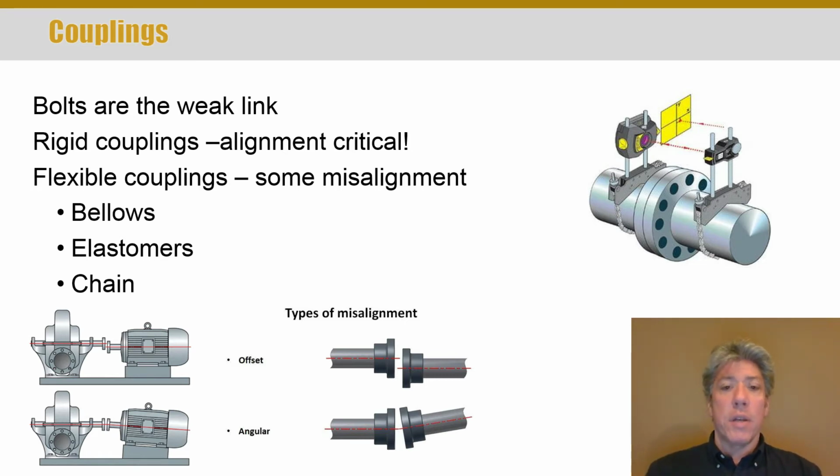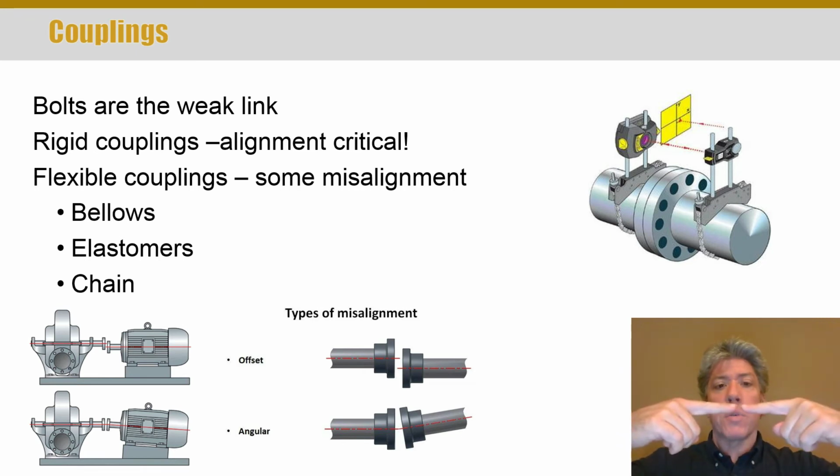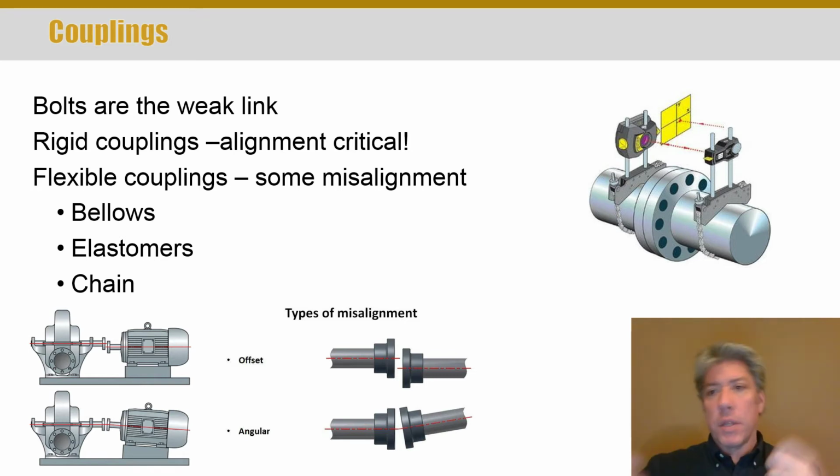so that it can be adjusted. Now, another type of misalignment some people refer to as axial misalignment, and this is where the two aren't quite close enough to bolt together, but this system is not for axial misalignment. Most of the time what you do is you put the coupling together, you bolt it not tight but snug so that there can still be some movement between the two, and then you rotate through, and there's hardly any axial motion to consider there.